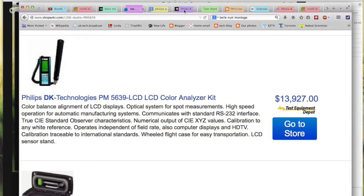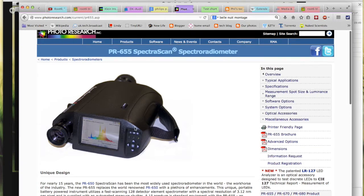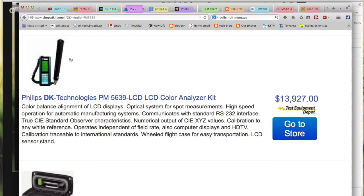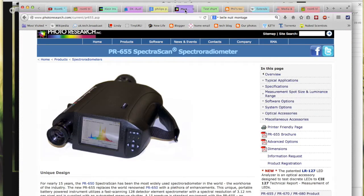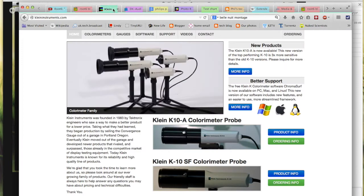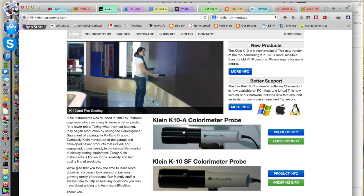But if you wanted to go all the way up to a device that could do any kind of display technology, it was something like one of these, a Photo Research PR655, a spectral radiometer, which does a wideband measurement. It measures all the wavelengths of the light, not just centered around the tri-stimulus values of red, green, and blue. But these are £20,000 devices, as opposed to photometers, which are typically £7,000 or £8,000 devices. If you want to do every kind of display device, you either arrive with several photometers, or it's a spectral radiometer. That's until Klein introduced this innovation, if I can bring up the right page